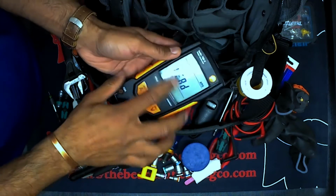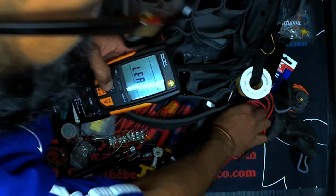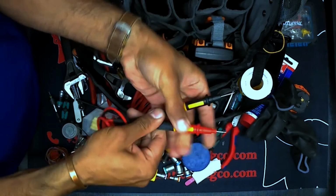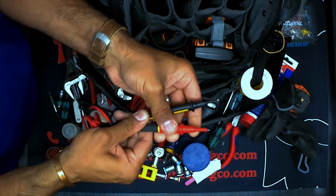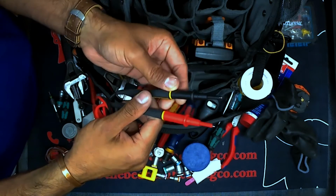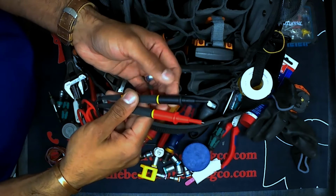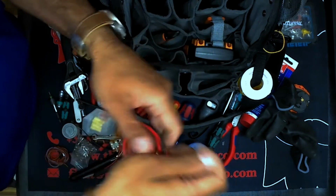It says leads because it needs a lead to be attached to it. The leads that I use now with this are the Fluke leads, because they twist like this, open and close, so you can get in there when you need to in the tight spaces, but otherwise you're complying with the GS38, I think it is, in the UK. Here there isn't much of a compliance with that, but I like to keep myself safe and obviously keep my fingers attached.